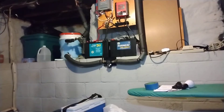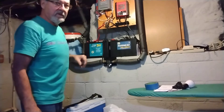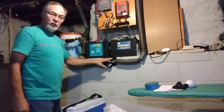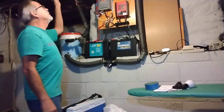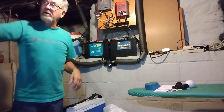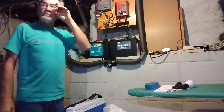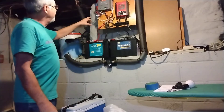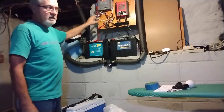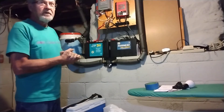Let's go downstairs and I'll show you what the rest is made up of. The heat exchanger comes down from upstairs, powered by this 12-volt circulation pump. It comes along these lines, goes all the way over in the corner to a school bus heater. When the temperature in the line reaches 138 degrees, this switch here — which I bought from Summit Racing, it's just a car electric fan trigger switch — comes on.